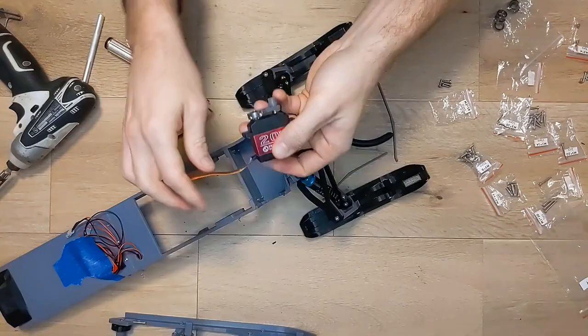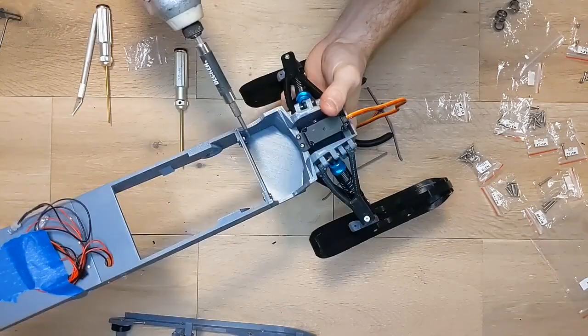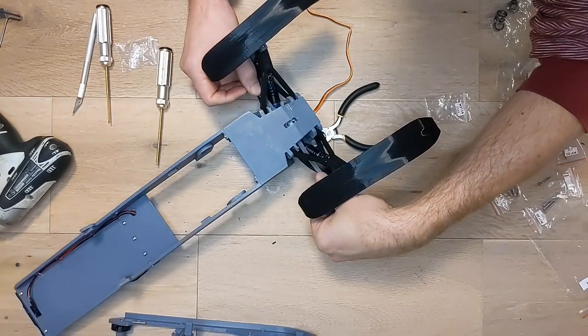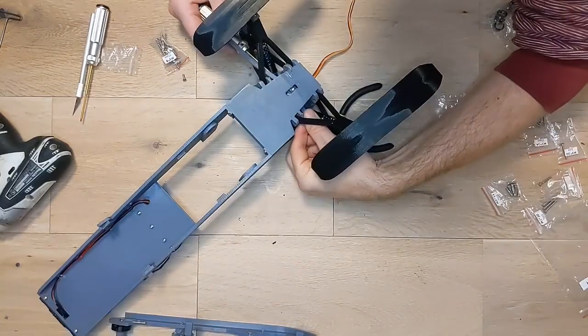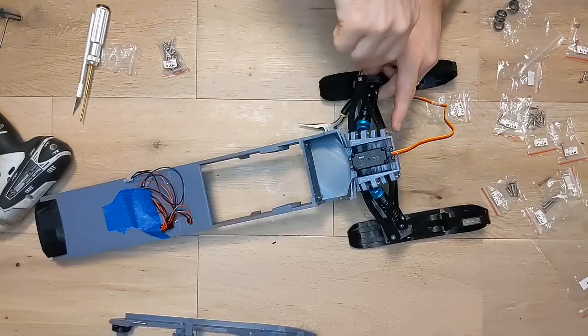Take a screw and thread it into the servo arm and then into the printed servo coupler a few millimeters until it's snug. If you're using a thin plastic servo arm you'll only need about an 8mm screw, but I needed about a 10mm one for this thicker metal servo arm. Then put the servo in place with the arm pointing towards the back of the machine and screw it into place with four M3 by 10mm screws. Flip your sled over and grab the two steering rods and try to set them in place so the holes in the ends line up with the hole in the steering coupler, then thread through a M3 by 8mm screw — don't snug it too tight as the rods will need to rotate a bit. Once the rods are connected to the steering coupler you can flip the sled over and connect the steering rods to the top of the steering knuckles with two M3 by 8mm screws. Your skis should now move in unison with the servo arm.